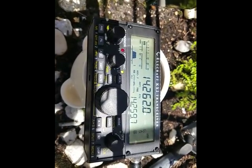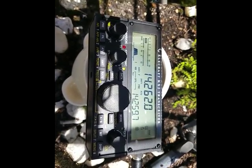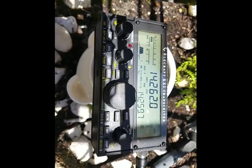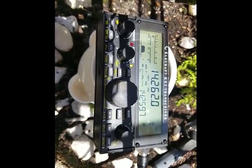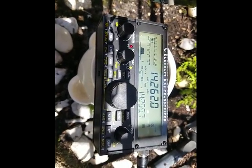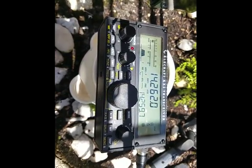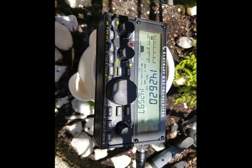Back to the same call sign — less QRM here on the magnetic loop, definitely. You can tell the difference. The signal is peaking to 5-5 with a much lower noise floor. As I said before, the size of this magnetic loop is 8 feet. Now, that's the bare minimum. If it is purpose-built for 20 meters, it should be a little longer. MFJ's recommendations are that this 8-foot size will fit 20 through 10 meters. I will also try to make a comparison with a slightly larger wire hooked up to the same tuner.